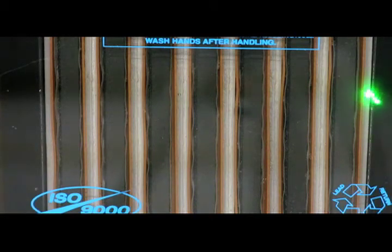At the end of the cell, we have negative plates at each end. The end negative may be thinner than an inside negative because it only has a positive plate on one side of it. We can see in this particular cell type that the inside negative plate is thicker than the outside negative plate.